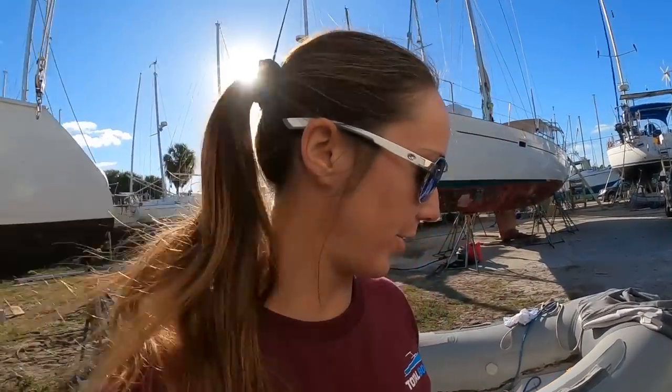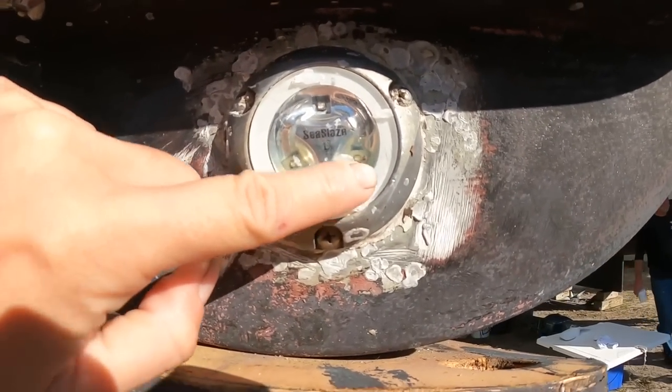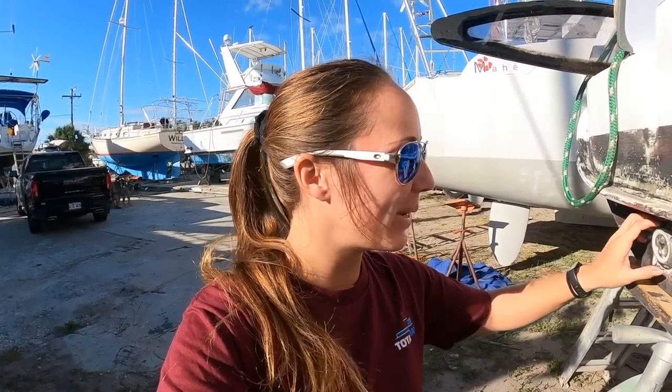Now that we are out of the water — we love our underwater lights, but unfortunately one of ours stopped working when we were in the Bahamas. It actually looks like it took on some water — it looks flooded. When we painted this the first time, I'm pretty sure I painted the whole light with the anti-foul paint, and it's aluminium, so the copper-based paint would not have been the greatest for it. So it did end up taking on some water, and that's why the light doesn't work.